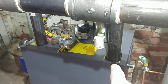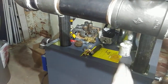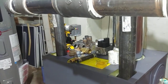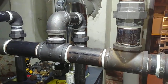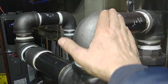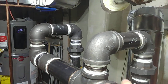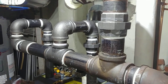For this SG-06, the manufacturer specifies the minimum outlet size: if it's five and under you can get away with one two-and-a-half inch outlet, but when you transition to the six, the manufacturer calls for both risers to be used and they're two-and-a-half inch. Then you're supposed to go into a three inch header. That's what the manufacturer calls for. About the only thing we do is add an extra nipple on each end and a short 90 and short nipple to make it a drop header, which helps assembly and dries out the steam.